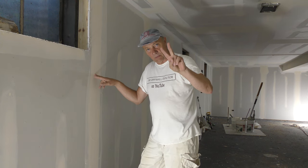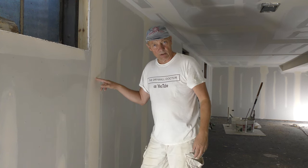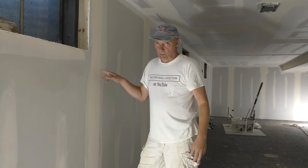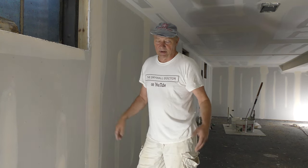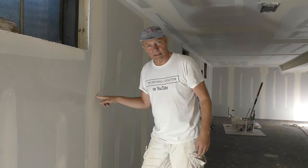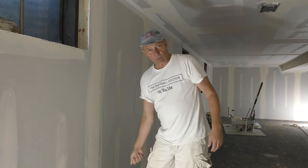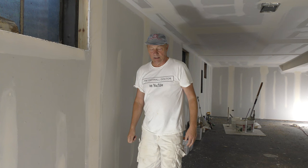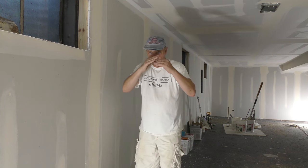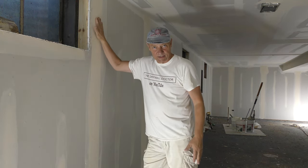You had two types of drywall. You had tapered edge, and you had SW board. This is tapered edge, because you don't see SW board anymore. But if you had SW board, you better pre-fill it. You'd never even be able to tape it, because if you went to wipe the tape, your knife wouldn't hit the tape. There was such a big bevel in there that your knife wouldn't even hit the tape on SW board. But tapered edge board, they brought it out a little bit, they just left the little bevel there, but the concept is still the same.